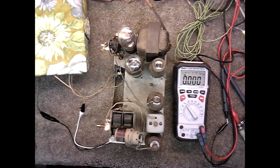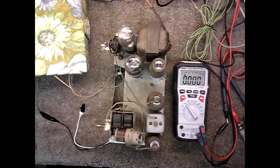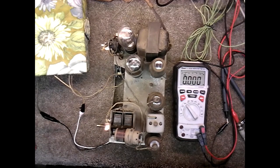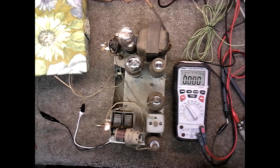That's pretty good. See if I can fix this antenna a little. Try to add one. See if we get a little louder on some of these stations. Let me get that off a station. You're probably gonna miss what I'm doing because I'll have to edit the video. It's playing that song too long. But basically, I'm gonna try to hook up a ground to this outside antenna and see if that might improve the signal some. Get this to connect to it.